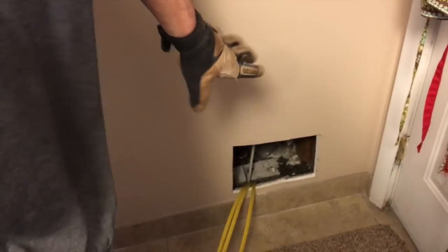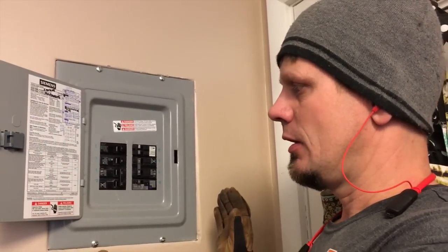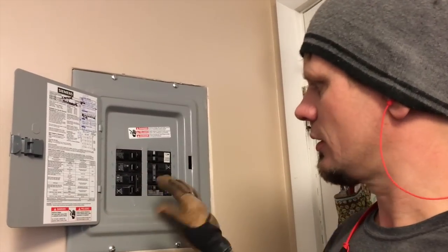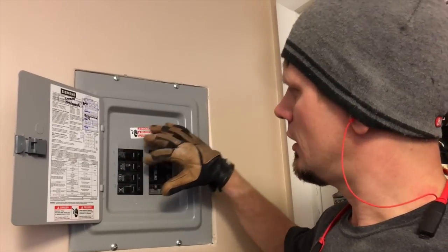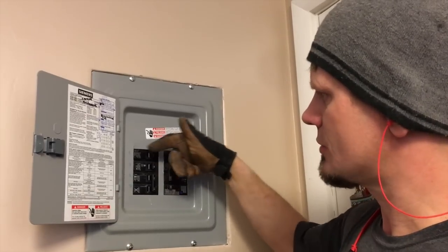The problem when I came here originally a couple years back was the plumber had to do some plumbing, so she was smart and left that hole for a few years. I changed out this panel because it was an FPE — this video is done in February 2018 for code reference. We were called to get rid of the FPE, so we did. There are four conductors coming here. When we originally put this in, my gut said to put in an 8/16 panel for space — meaning eight full spots or sixteen small.